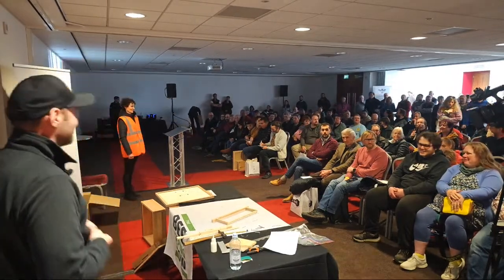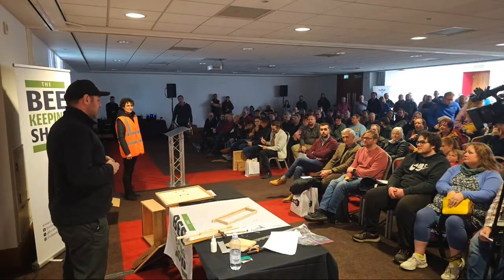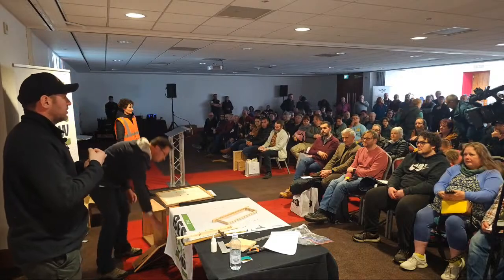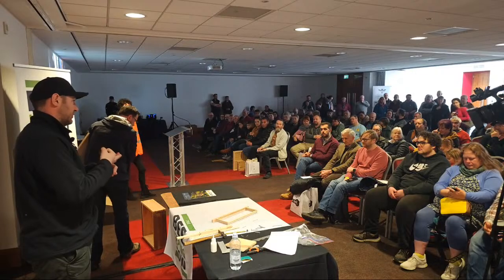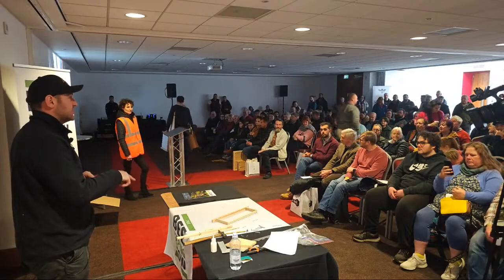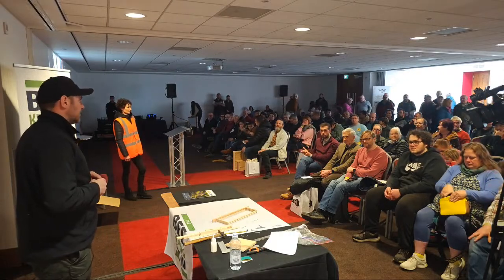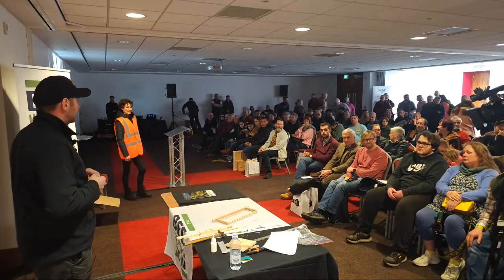Question: can you use a nail gun? Yes, definitely. I use a nail gun for making up frames as well - I've got a 23-gauge pin nailer for frames and an 18-gauge brad nailer. If you're making up a lot of boxes you probably want to go with a 16-gauge nailer and make sure you're using stainless steel brads. It saves tons of time and you don't get any that are bent. Definitely recommend it for frames as well.